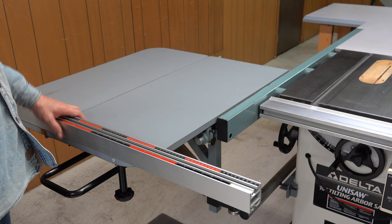Number 43. I added this as just a quick way to turn on and off vacuum. So when I move to the next machine, I'll have as strong a suction as I can possibly have. And it's just a simple cord that it's pulling on, a leather cord, and pushing on it to open the blast gate. But just something to think about when you're setting up a shop.